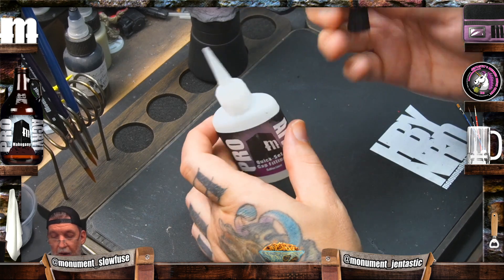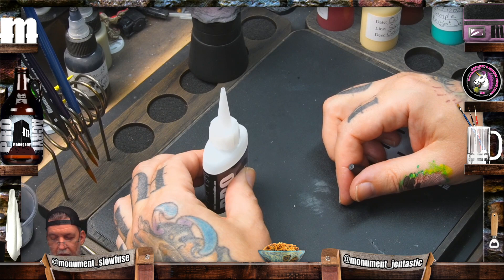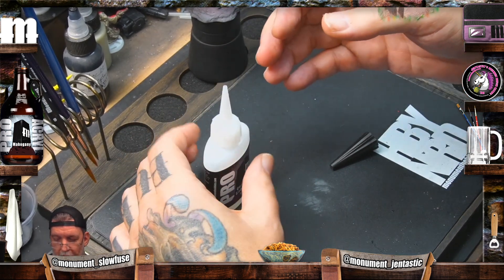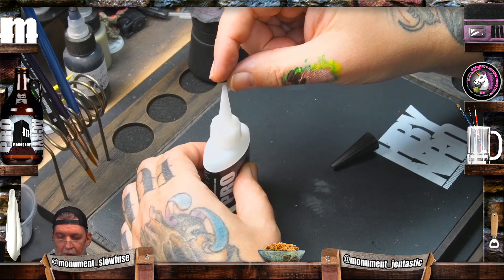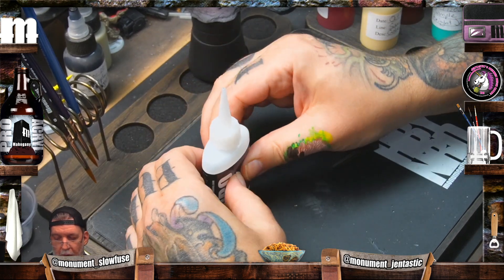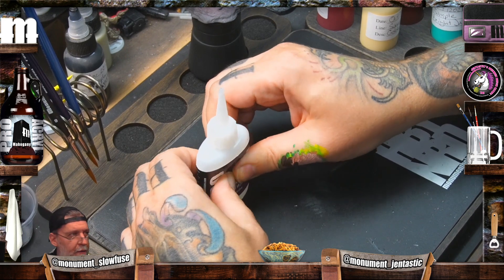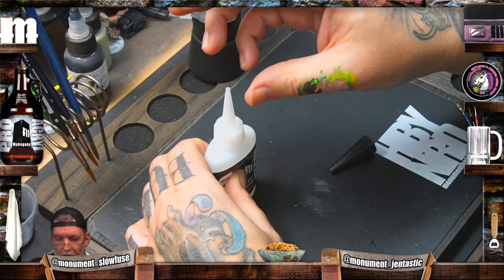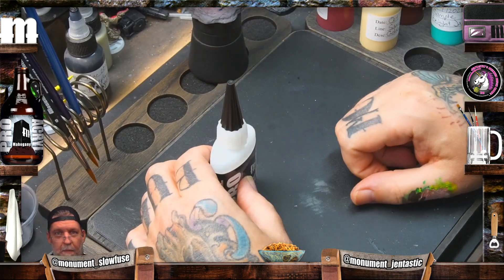The thing to do is always test first. But you can help it: just set the bottle upright and give it a little press. Once you've just used it, tilt it upside down, squeeze it a little with it upright, and you get a little super glue bubble that'll come up and pop. Let it go, and when you push again you'll get none of that. Squeeze it until that little bit of super glue comes up and pops, wipe it off with a paper towel, put the top on — then you'll never have that problem again.